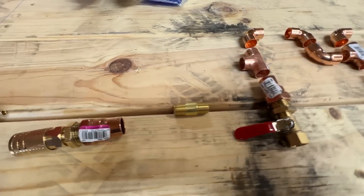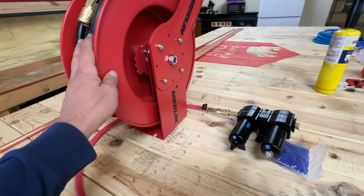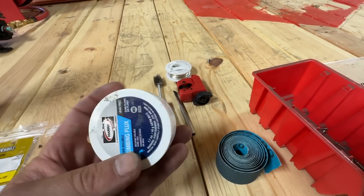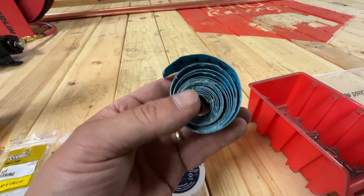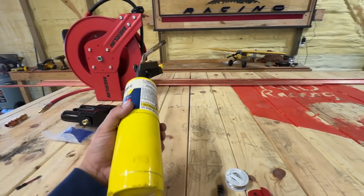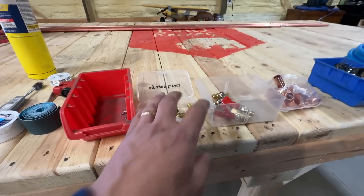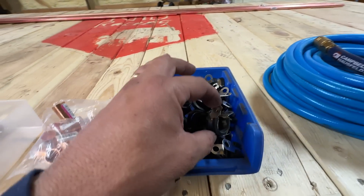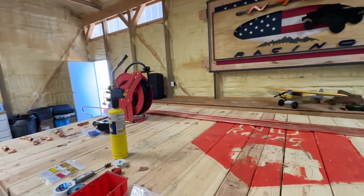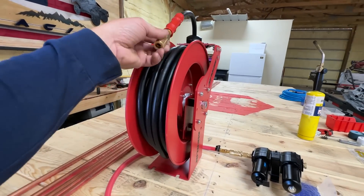We're going to do that twice, and then we're going to kick the air off through some more fittings, through another hose, into this Harbor Freight desiccant filter. We'll get that thing set up, and then finally into this Merlin reel. What we're going to be using is one of these kits right here — super easy, and I'll link for this in the description. This is some flux — what you basically prep the surface of the tube with. Here is what you prep the inside of the tube with, a tube cutter, and then some solder. To heat it up, I use map gas. I think this probably overheats a little bit — you could probably use one of the propane torches. And then we have some fittings here, links for all those in the description. And how I'm going to mount those to the wall, I have some brackets I'll attach with screws to the wood around the shop.